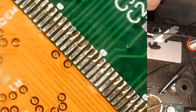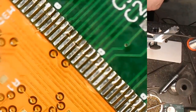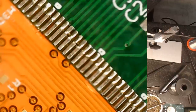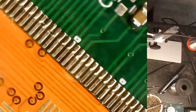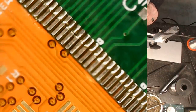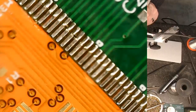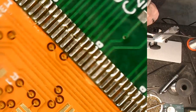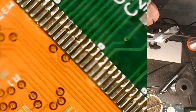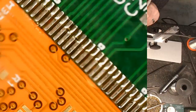So let's go ahead and do, I guess, the most basic thing, continuity. I don't really know how this board works, but I'm guessing this is some kind of ground connection here. Oh, hang on, here's a ground. There's loads of capacitors here, so these must be ground. Yeah, there's our ground. We got ground on this guy. And so we should have ground on one of our... Yeah, there it is. Got ground on this little op-amp chip. And we should have some grounds here, yeah, on our STM32.